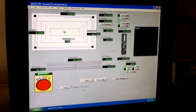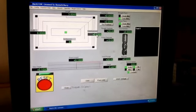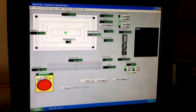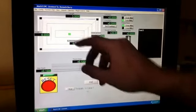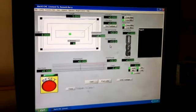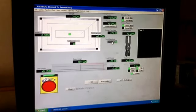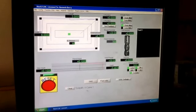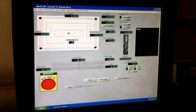The X position and the Y position are where you're going to start, so just leave that at 0. The finish amount is irrelevant here because this is how much it'll go down on its last pass to surface, but we'll cover that in a second. Feed rate, choose whatever feed rate you want. I usually do something ridiculous like 300 inches per minute. And the tool diameter is going to be set here. All you need to do is tell it tool diameter, and we're going to use a 2-inch tool diameter.